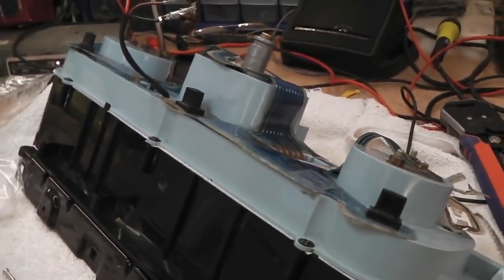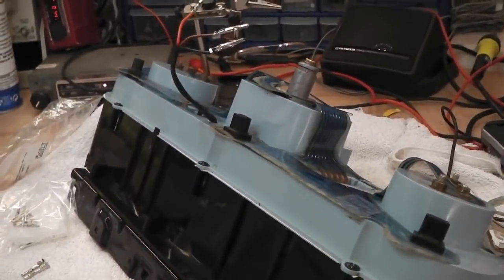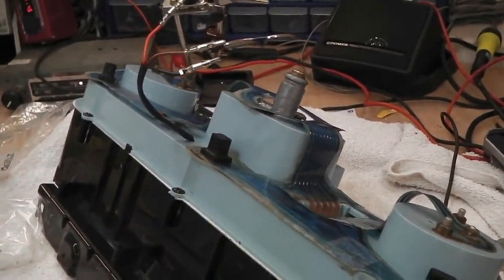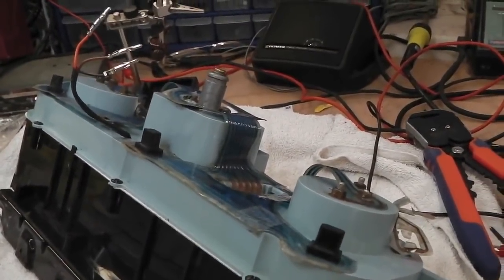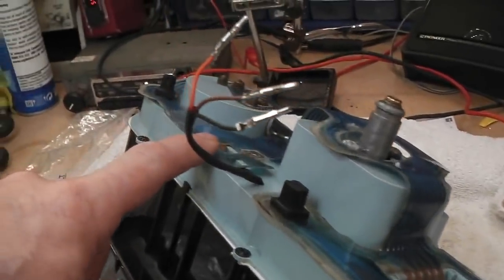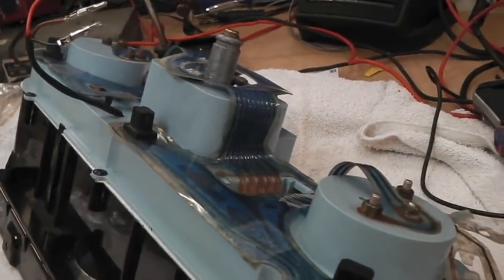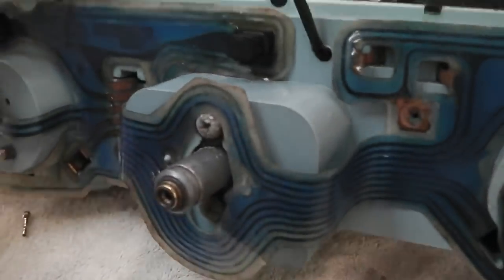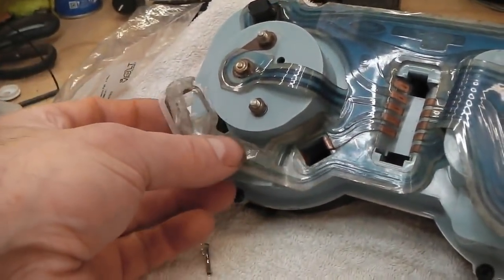We're going to tidy up some space, move the dash frame out to an easy position because it's on wheels, and we'll start a little bit of dash building then this is nicely secured out of the way into the frame of the dashboard. I'm just trying to think off the top of my head if there's anything else missing. Don't think there is. We need to fit all the bulbs now into this. Check them all. Clean these contacts on the circuit board at the back. Like I said, it isn't the best circuit board, but everywhere else is okay, but just there. So we need to just tidy that up and repair that.